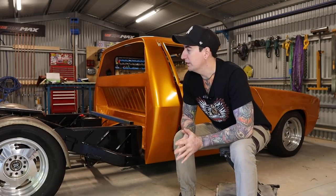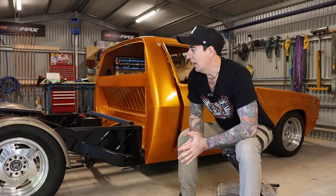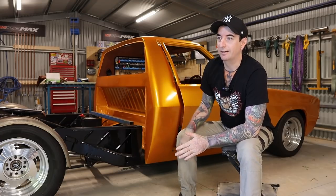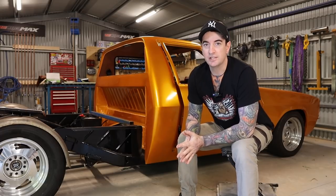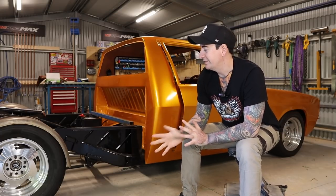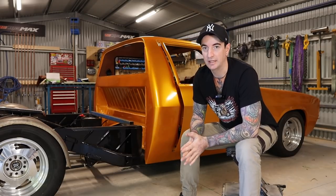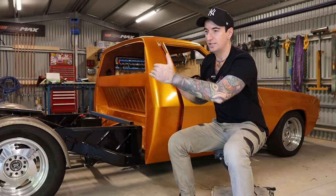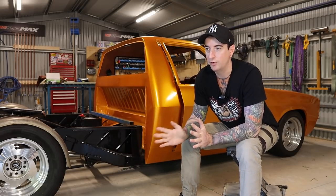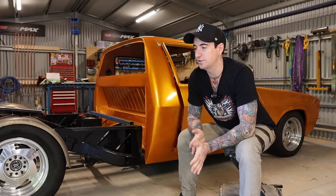I'm thinking what I am going to do is pull that rear cross member back out and then do a relief cut. I'm leaning towards that way. That way I can do it in the shed. I rang a few places up, some chassis alignment places, and they said they're pretty booked out. They can't guarantee when they can get it in or have a look at it. So I think that's what I'll do. It's only in that foot and a half of the rear chassis there, so I should be able to fix that myself.